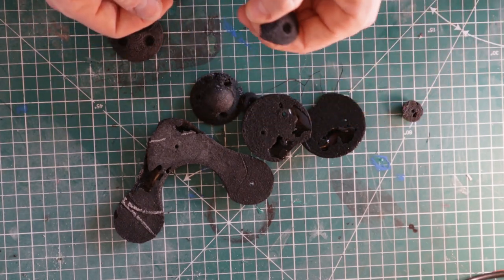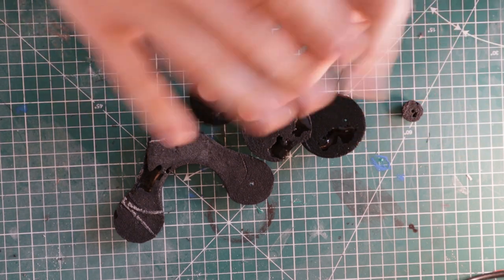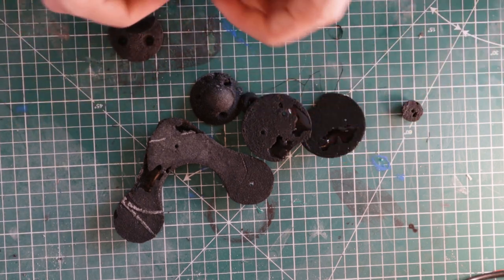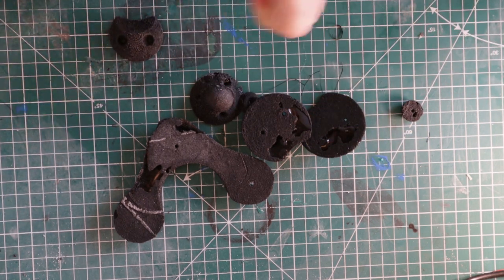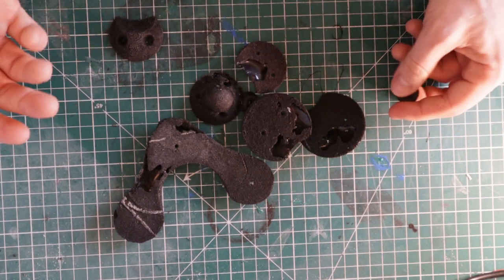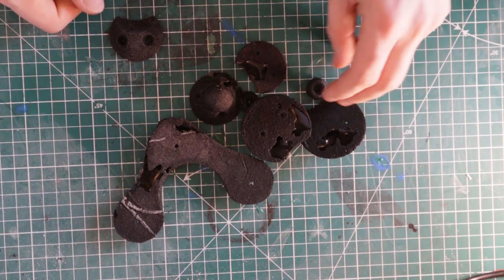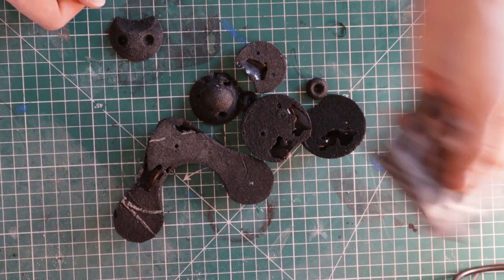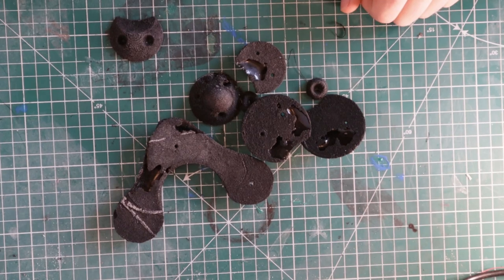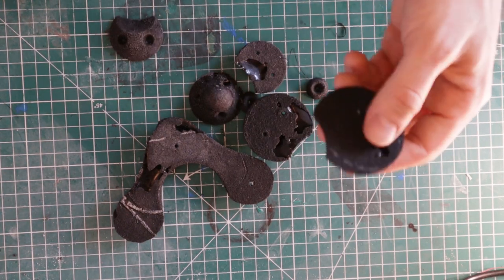What I've been doing is putting them purposefully face down so I get these voids on the back of the hold, which doesn't really matter — but it's not ideal, we don't really want voids. One of the things I'm going to try is various ways of packing the salt better — more salt is going to be good, and putting like a bowl on top of the salt just to press on it. The problem is that hot powdered salt is really corrosive, so you have to be quite careful about what you use.